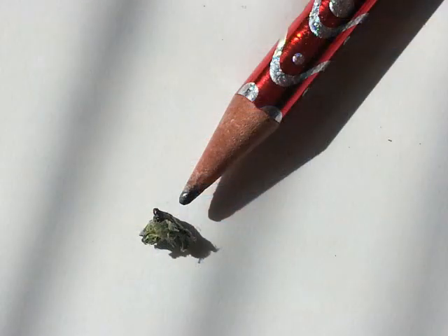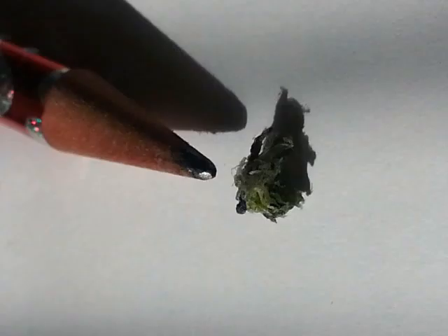As you can see, it looks like a bunch of fibers and things that combined with melted plastic and rolled around inside there, and occasionally would jam the nozzle, and I couldn't get it out for the longest time. I finally got it out through PLA fishing using a little nylon trimmer line and heating the nozzle to about 170.